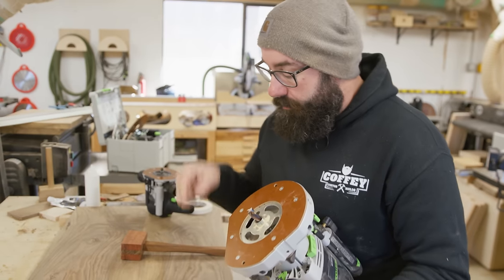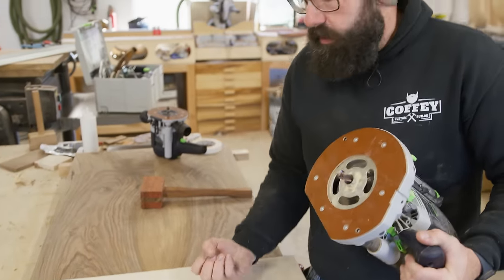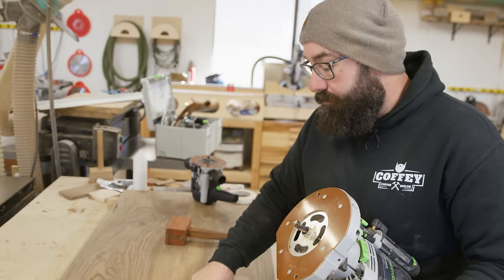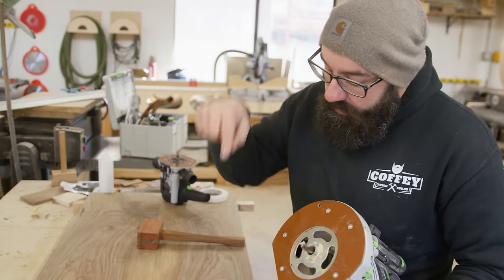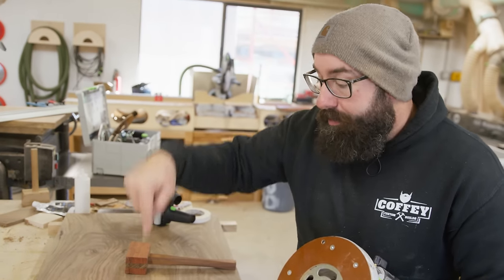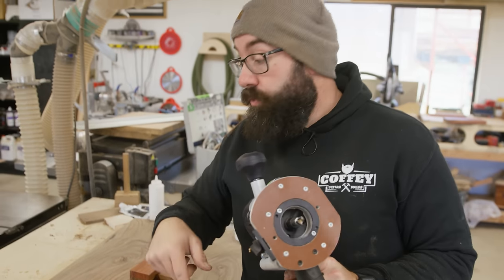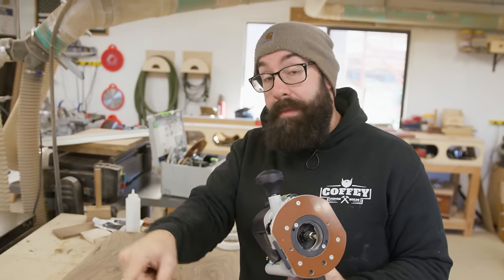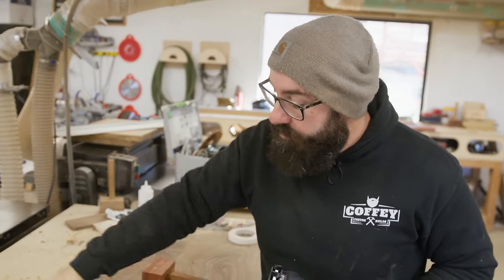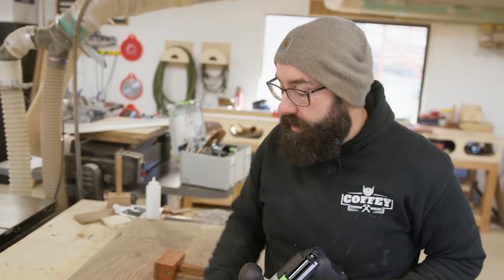I'm using this compression bit. I like it because I'm going to make my first plunge sort of in the middle — this is an up-cut here, so it's going to pull fibers up, but I'm doing that towards the middle of the mortise so it doesn't matter. When I get below the up-cut line, I'll have the bit pushing down, so it'll be a nice clean cut around the top, but when it gets through to the bottom it'll be pulling up and I won't have blowout. After I remove the majority of the material with that bit, I'll come back with this smaller pattern bit, follow around the perimeter to establish an edge, then rip the template off and use the pattern bit to continue all the way down to get right to the edge.